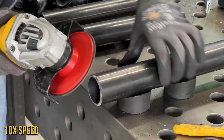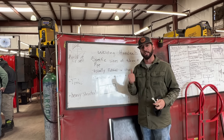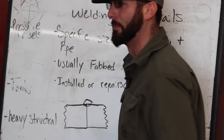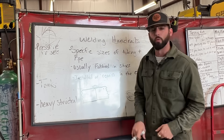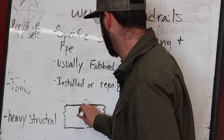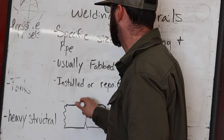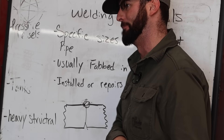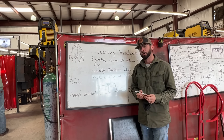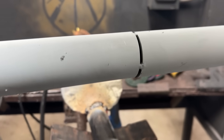So that's what today's episode is about. Prepping our tubing is going to be one of the biggest aspects. We've got a little bevel on all of our tubing because we want penetration, since we're going to be blending these welds afterward. We don't want the weld just sitting on top with minimum penetration, because as we go to blend that weld off, there won't be a lot holding us there. That's where a lot of welders mess up — they put a decent weld on but once it's blended, you start seeing cracks.